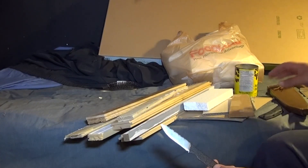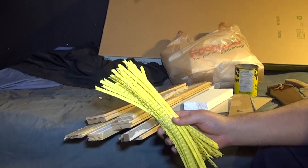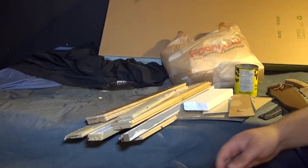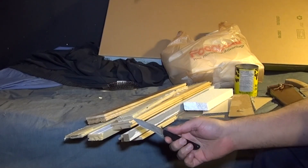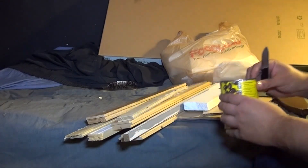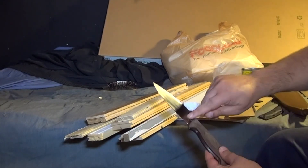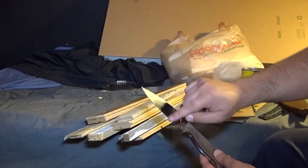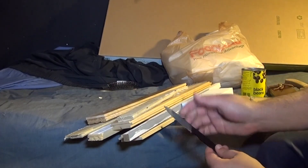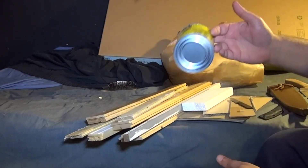After cutting up the wood, I cut up some light plastic, some pop bottles, some heavy plastic — retention ties left over from screws from a screw gun, much thicker than your standard zip tie. Finally, I cut up some aluminum cans and then actual food cans. None of the work rippled the edge bevel at all. The apex grind, the actual final grind, was undamaged. The only damage was the very apex — the actual very front of the edge itself rippled, and it only rippled on the food cans.